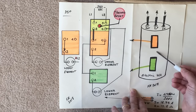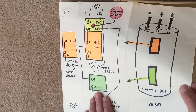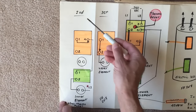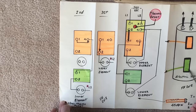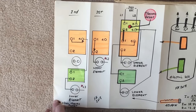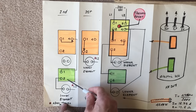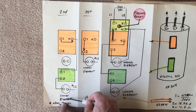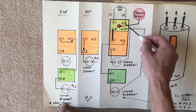Once the upper portion of the water heater is satisfied by reaching the desired temperature, condition 2 can take place — assuming the temperature at the bottom of the water heater is below our setting and we're calling for heat. When we call for heat, the lower module comes into action, and current flows from terminal 1 to terminal 2, powering up the lower element. The other side of the lower element connects up to our thermal reset.